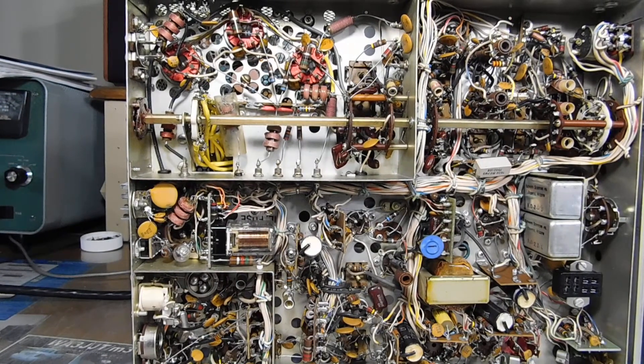Whatever event took place that caused the band switch to blow up and all that ceramic stuff to go bad rather violently also had an effect on the TR relay board. There are three 1N4148 diodes used in the relative power and metering circuit that were all shorted. There was actually a little bit of damage to the back of that board once I got it out of there. Kind of fixed that up. Put the fuse lamp receiver protector back in. Straightened up some of the wiring by the power connector, and just cleaned up the controls and the band switch.